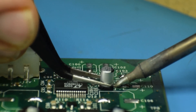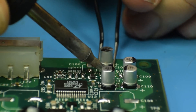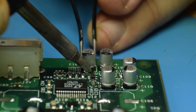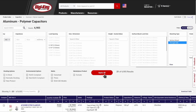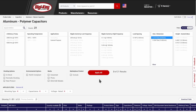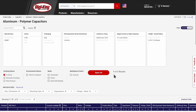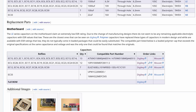We should consider ourselves lucky that for most repairs it is still possible to find compatible parts. But we're going to start finding more edge cases like this over time, where it will become increasingly difficult to find new parts. Back to my board though — I still needed caps, so I decided to try and find some polymers that I could make work. Unfortunately, there are slim pickings for drop-in replacements, because at the same time the industry shifted from through-hole to SMD packaging. But I found one single compatible part that would fit. It's a good brand, Kemet, and exceeds all of the original performance standards, which isn't too surprising being polymer. The other caps were much easier to pick out since they were all more standard, so I got those chosen and had my final capacitor list.